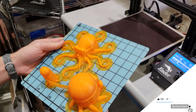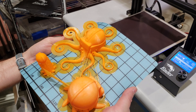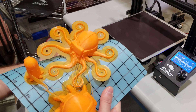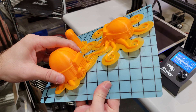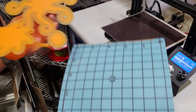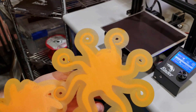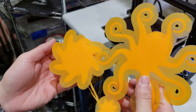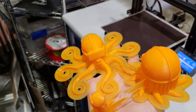So this is the bottom section and this is the top section. Let's focus on how this plate is going to help us remove the objects — what I'm going to do is bend this plate. As you can see, it was very, very easy and nothing was left stuck on the plate, so everything released properly. Let's take a close look at the bottom of the octopus print — I'll call this bed adhesion successful.